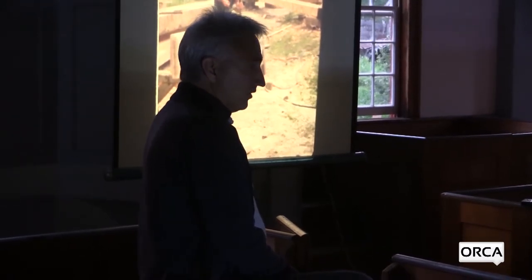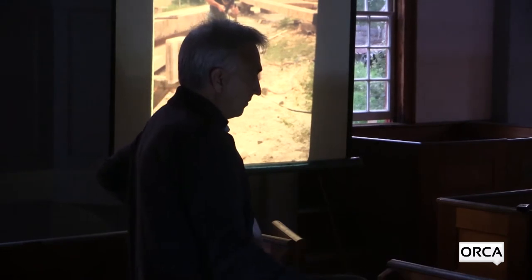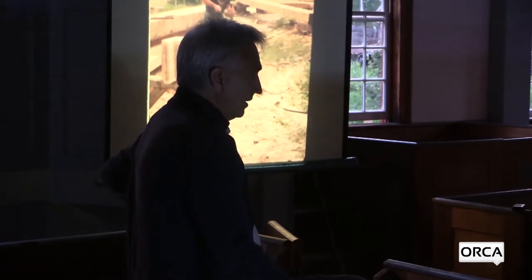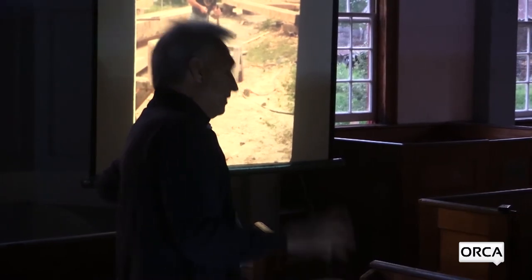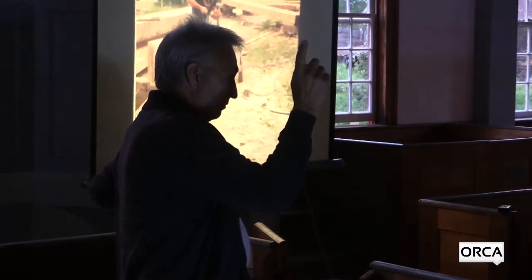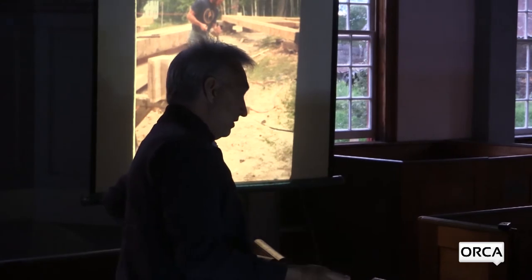And they built it on the ground where Stafford's store is. They built a tower up to 100 feet, then they built up to 80 feet, then they built 85 more feet on the ground. They finished it in every way, covered in metal, painted it, put the weather vane on top, and then they got a man named Mr. Edgerton from Charlotte, who could move anything that wasn't fixed down. He came with one horse, a lot of rope, capstans, block and tackle, and he got a 100-foot tree from Orlo Judson. He put the 100-foot tree up there as a gin pole, hooked onto that spire at Stowe, and brought the 85 feet up 80 feet and plunked it in position. That's a real good account of it being done.